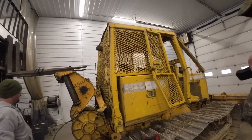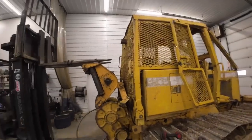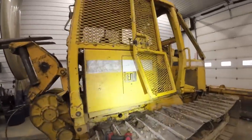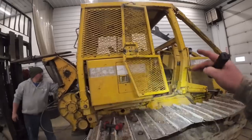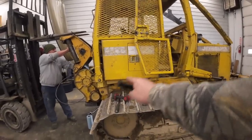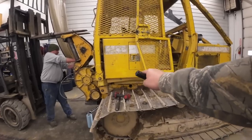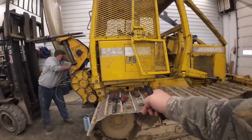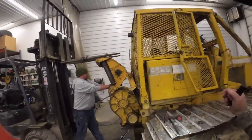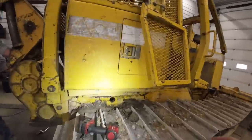These are good old tractors — all mechanical. We've been doing a little investigative work. Basically you've got a four-speed transmission inside. There's a brake band around each one of these sprockets. There's a clutch pack that kicks that track into neutral, then a brake band grabs it and clamps on that drum, walking that track up allowing you to make a pivot turn. There are adjustments inside here.